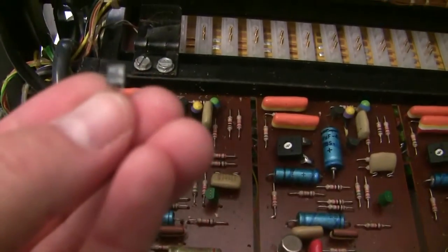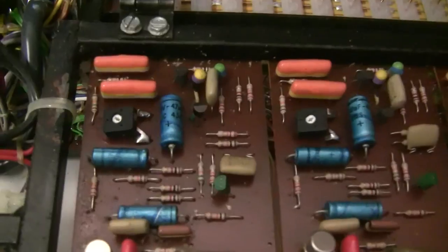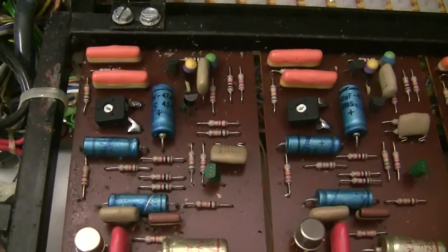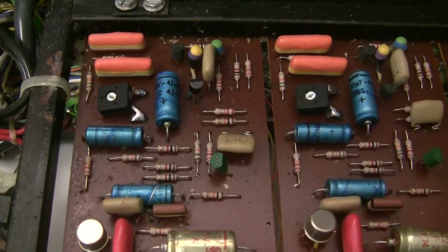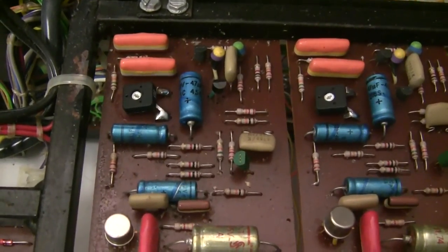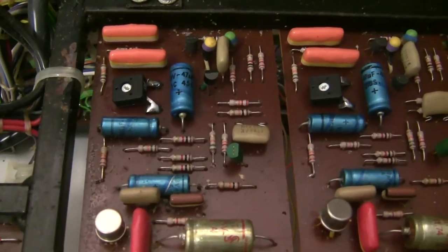It is a, what is this, a BC-169B, which is out of print, or out of production. But it's just a standard NPN transistor with a kind of a medium gain. I used a 2N3904, which is plentiful. The gain is a little lower than the BC-169B, but in this application, how it's being used, it's an acceptable substitute. Generally, when you're replacing a transistor, you want to match, use ones with similar gains.